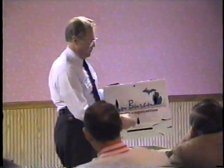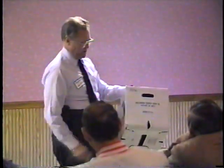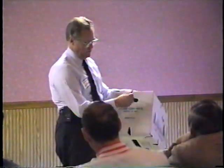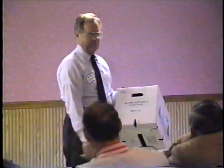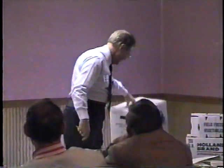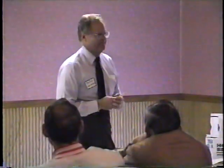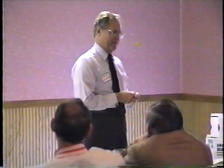This box has a ventilation hole and drain hole, and some ventilation from the top but nothing in the end — so it maintains pretty good structural strength in the corners. A hand hole really destroys compression. That area in the middle is your 40 percent, so don't put the handle in the corner. You get about 80 percent more compression by keeping slots and hand holes away from that four-inch corner zone.